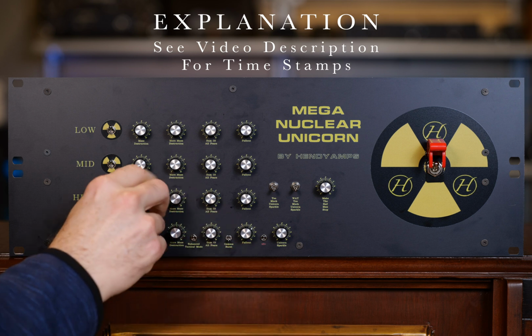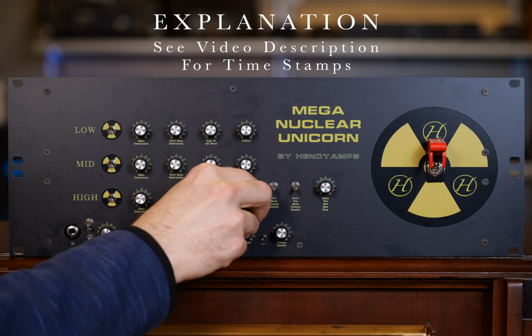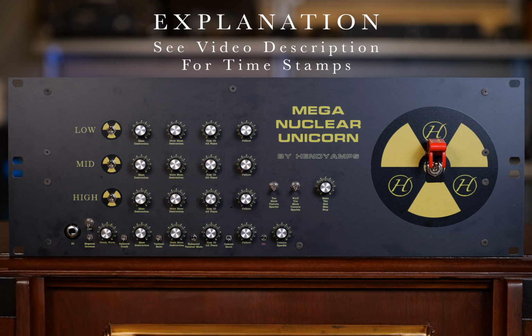Gain down. And now you hear the highs. And I chose the cutoffs of these because while you may have a high cut or a low cut or some kind of cut for one application, like a clean application, it will shift as you distort, because no matter how much cutting you do, it starts to kind of squash together. And so these curves will actually be a bit changeable depending upon your gain settings.